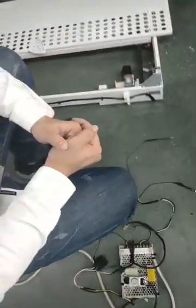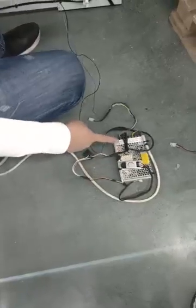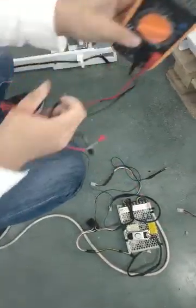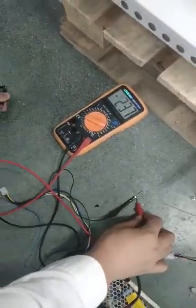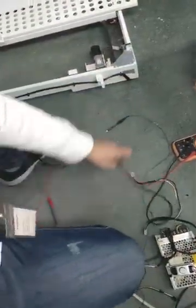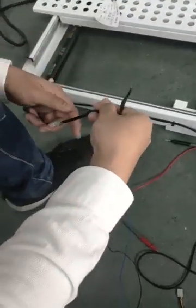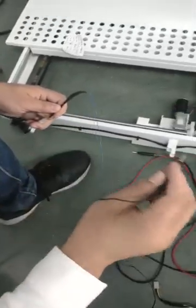If the micro switch is normal, we prepare the power supply. Set the output voltage to 24V — we can test the output is about 22V. Make sure these two pins have a short circuit, then we give the device power. Don't worry about the direction.